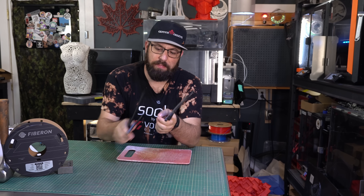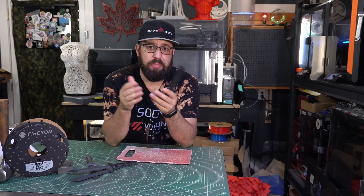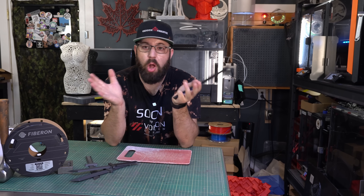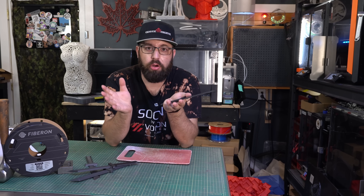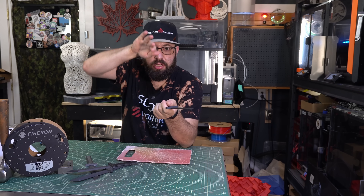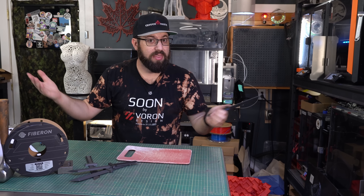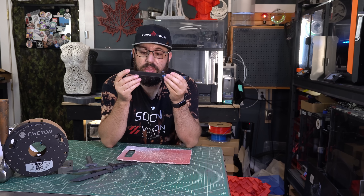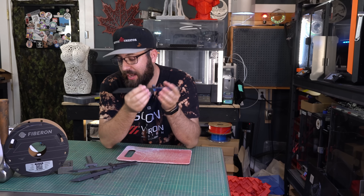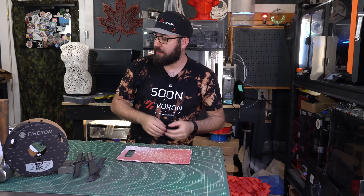The big difference is layer height. Because it is a 20 degree angle for the blade, the thinking is: the smaller your layer height, the more sharp the knife should be — instead of a sharp staircase, you'll have a very smooth gradual slope. And hopefully with a smaller first layer, we'll have a finer point. No sharpening — these all came straight off the printer.